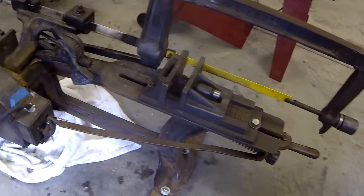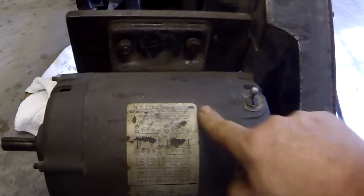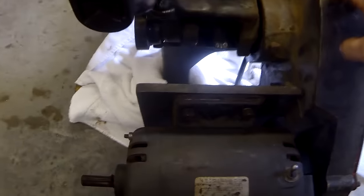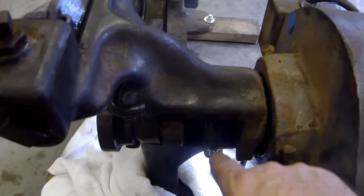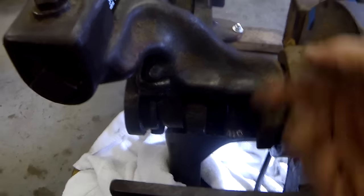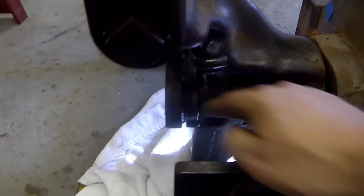I want to show you some detail of the Marvel saw. The motor I installed is a three-quarter horsepower — up from the original half-horse, so we've got a little more power. The gearbox is filled with 90-weight gear oil, which makes it run a lot quieter. In the back there's a place for oil with a felt pad — it oils the shaft and also lubricates the cam and eccentric.